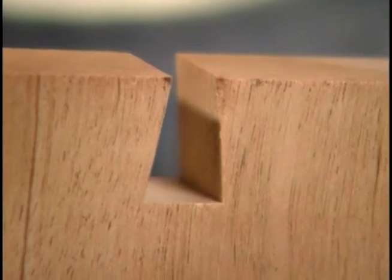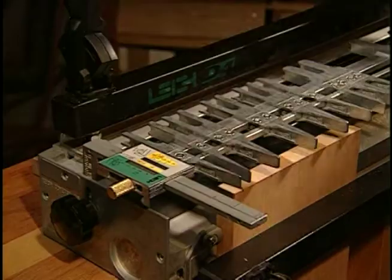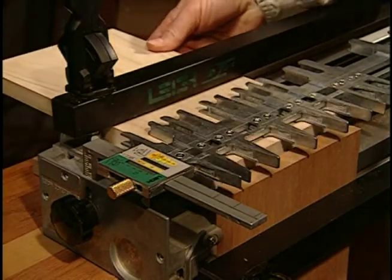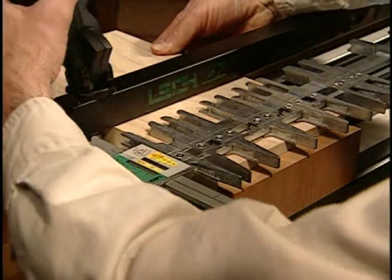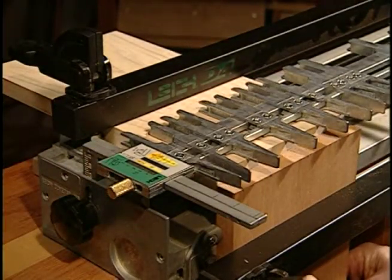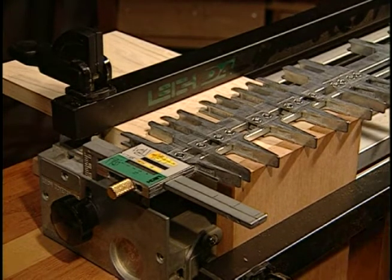With the dovetail cutter, most tear out occurs at the top left exit of the cutter. To help prevent this, back up the cut with a horizontal board with its end grain pushed against the back of the workpiece and held in the rear clamp. This same scrap piece can remain in place for successive cuts.